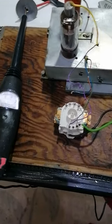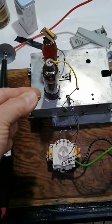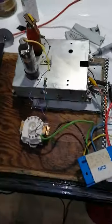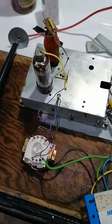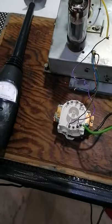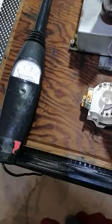A single BY8210 — one of these single BY8210 things here — I put that on to check what kind of voltage I was getting. I was getting about 8kV. Really good. Now, you'll notice at the moment I'm using a different line output valve. I'm using an EL36 in there at the moment, and this is a bit of a cobbled-up job.